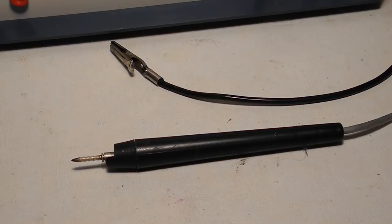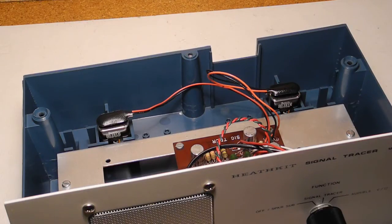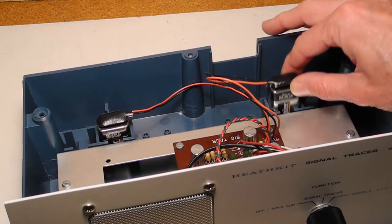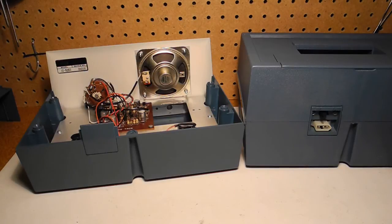The test leads have an internal switch marked AC and DC. This was actually the probe used for years by Heathkit in their VTVMs, an example of using existing parts to save costs. It uses the same battery holder arrangement as the other units in the series with two 9-volt batteries. This unit does not have the optional connector for the external AC power supply — the parts for this came with the power supply kit and consist of a different cover plate with a switch and connector.